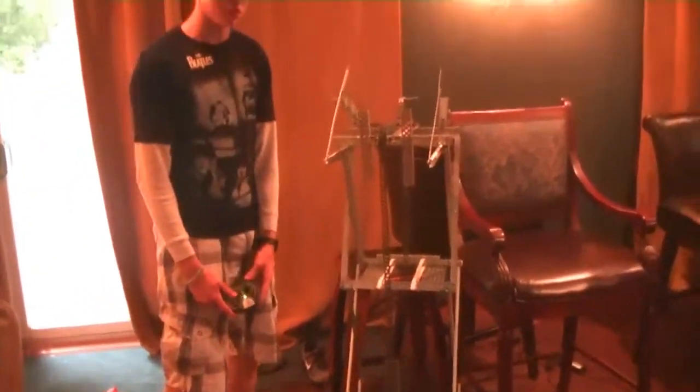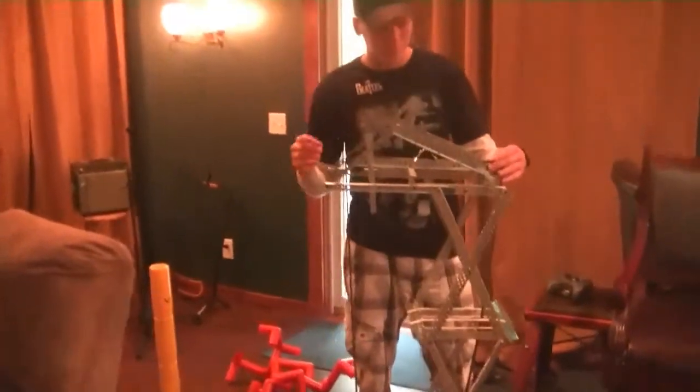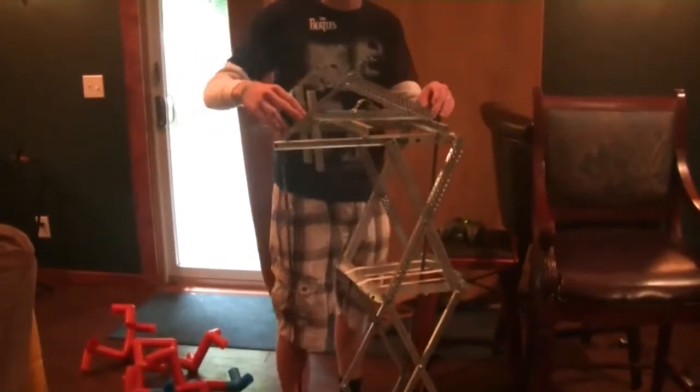To deal with the weight of the cubes on the gears, we had some problems with the entire scissors lift collapsing. So we actually solved that by adding a simple contraption onto this part right here. As we're raising the scissors lift, these 2 metal pieces attached to this hook, as it goes up, push against this beam, and once it reaches the highest height, lock around this bar and lock it in place, so no matter how much force you put on top, it can't come down. So that's how we fixed the problem with the weight of the blocks in the scissors lift instead of the strain being on the motor.